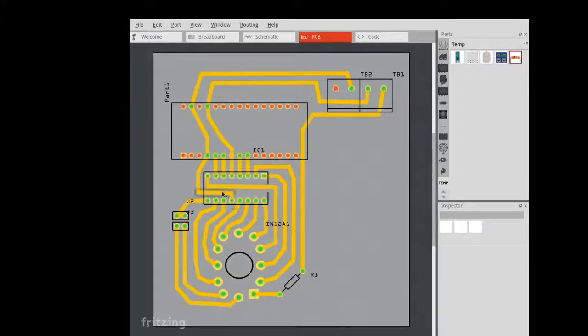But I would like to point out one thing, and this IC can actually handle only 10 output points. Okay. So that's digits 0 to 9. That's 10 outputs. But if you look at the Nixie, it's actually got 12 pins. So if you count one of them as the power pin, that's this one, the anode. This is the anode, and it connects directly to the power supply. The other 11 pins. So how would you control 11 pins on the Nixie with only 10 on the IC? You can't.